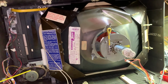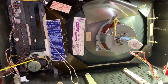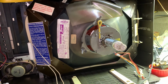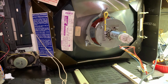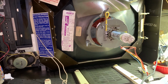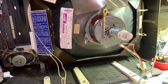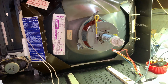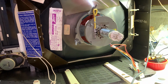And one thing I forgot to mention is this TV was gifted to me by Emerson Colley several years back. And it worked, again, it worked. But given its age plus the known issues with the 9160 board, this is all preventative maintenance that we're going through now. And I never did any tune-ups on it, any adjustments. You know, grayscale needed tweaked a little bit, focus maybe. But starting with the capacitors.